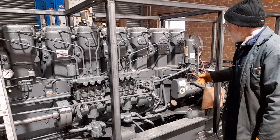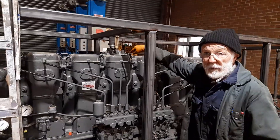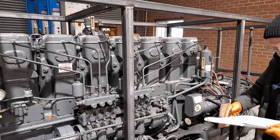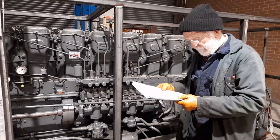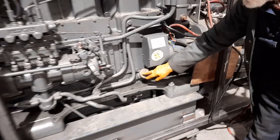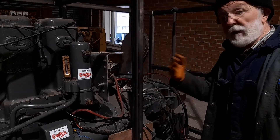You'll see two thermostats — one here and one at the top. In fact I think there are three thermostats up here. Three thermostats, so if one sticks, there are another two there to take over. The alternator drive comes off here, though sometimes they also come off the front. There's a valve here which enables you to isolate the hydraulics on the gear change. I don't want to talk too much about the gearbox because it's the same as the 2UC gearbox, which I've already discussed in detail. We've checked this arm and it's locking back and locking forward — no problem.